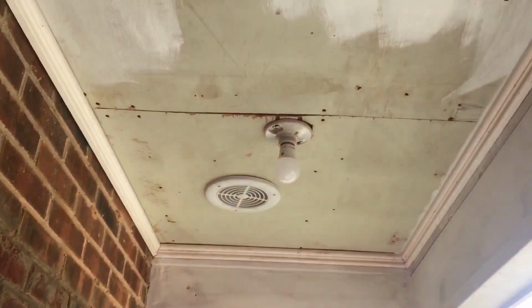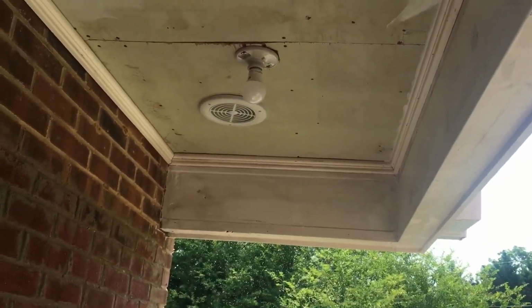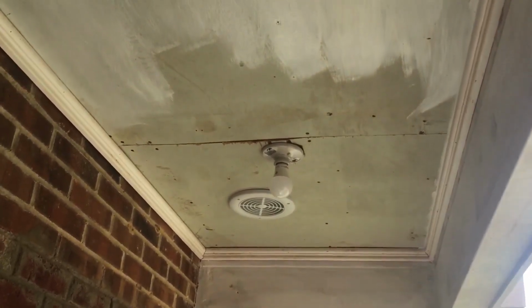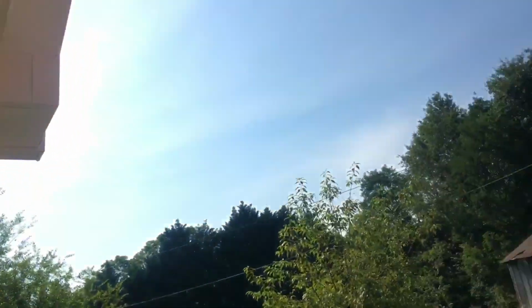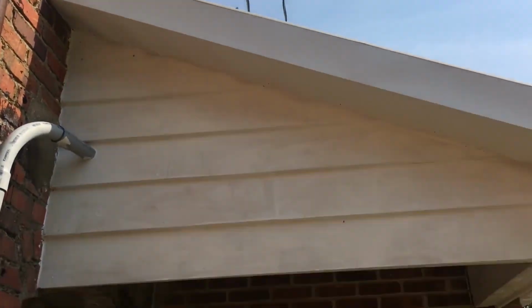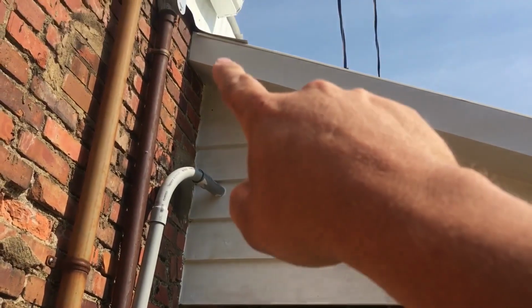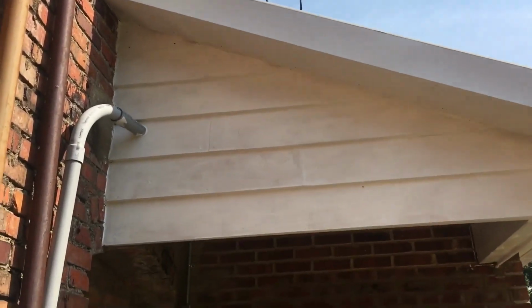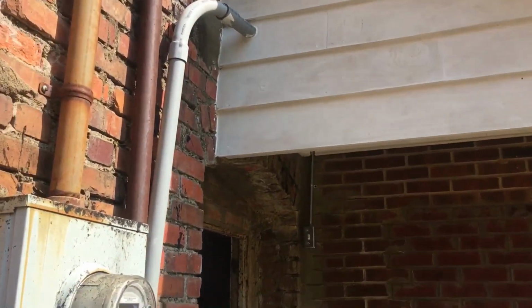So I'm basically, let me get down where you can see here. Ouch! I just ran into the wall. I'm basically going to get my bead of caulk on all this and get it ready to paint a second coat on it. You can see I stopped right there with paint. I've come out here this morning and I've caulked all this over again. The spots that was bad, went around that pipe real good there, and there was a few cracks. You can see in the beginning of this video where the caulk kind of cracked a little bit.